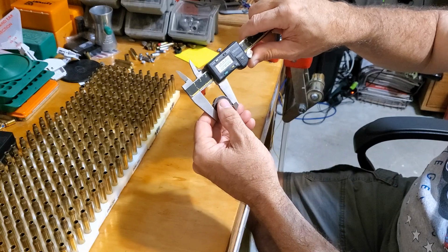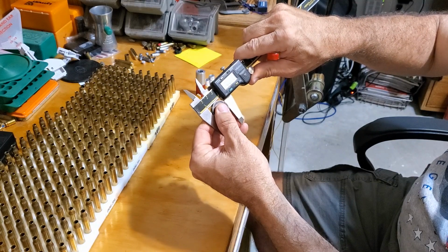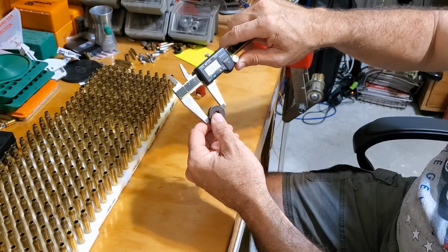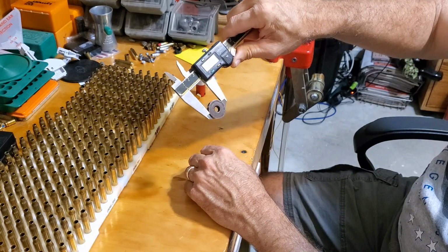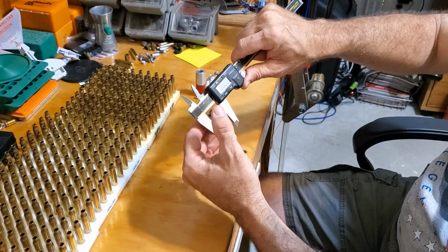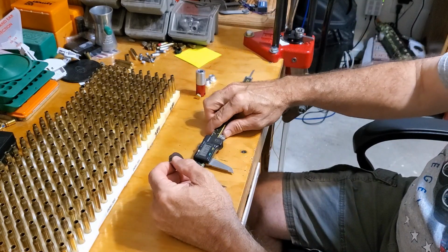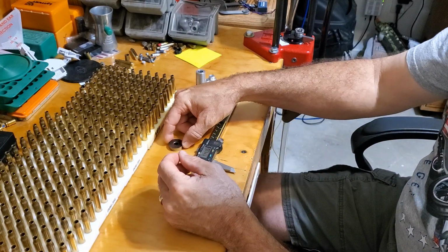Now, there's 1 inch. But watch, if I go up top here, push this thing as far as I can, push really, really hard on that tool, and it moved 1/1000. You go down here, if I push that hard down at the bottom, you're there. That's 5.5 thousandths. But if I learn that feel by practicing over and over and over just how to do it, you'll get more consistent measurements. It's just a matter of practice